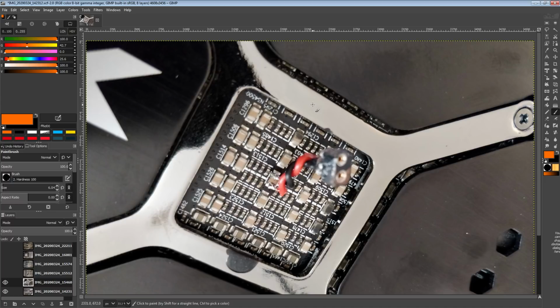So, we shouldn't really be near the inductors. If you're on a motherboard and you put an oscilloscope probe anywhere near them, you're going to pick up inductor switching noise, which you don't really want in your measurement. On the other hand, with a GPU, the inductors are on the other side of the PCB, so between the inductors and the probe there's a great big ground plane, and also the backplate on these cards. So it's not really much of a concern.